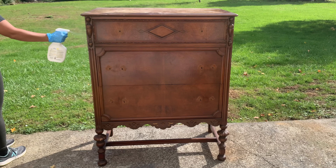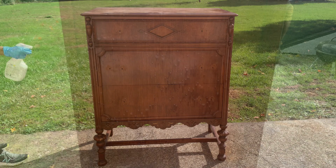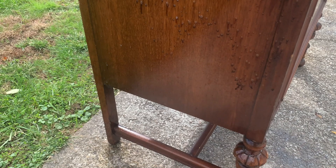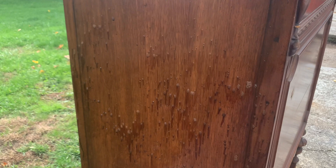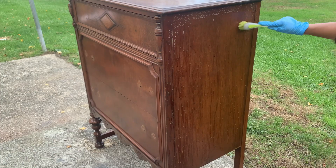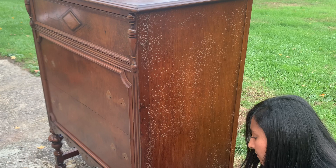Next I'm going to start cleaning my piece. I usually don't spend too much time in my videos showing the cleaning part, but this piece is lending itself to show you what severe bleed-through looks like. Fortunately I picked a dark color for this job, but if you want to paint with light colors you're going to have to prime your piece with a stain blocking primer and probably do several coats. I like to use Crud Cutter to clean my furniture because it's good at removing oils, dirt and grime. I can tell whoever owned this piece loved using Old English oil, but that's okay. After scrubbing and rinsing over and over again I managed to clean and prep it for paint.